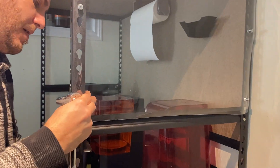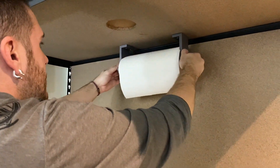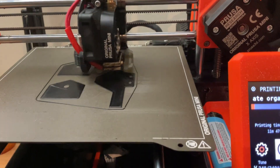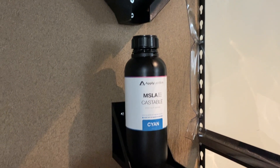You'll notice we didn't use any plastic across the back of the shelf — this is where that fifth shelf came into play. We put it flat up against the back because it not only helps with containment but we can also screw things to it. We're going to have organizers, a place for our resin bottles, and all sorts of accessories to keep on hand. I've designed an extra build plate holder to attach to the back when not in use. We'll also have a shelf for draining resin bottles, a holder for the vats, a place for the funnel, rubber scrapers for cleaning vats without damaging the FEP, and hooks for hanging tools, pliers, scrapers, wipers, cups, hex keys, masks, and gloves. Just make sure it's everything you need immediately.